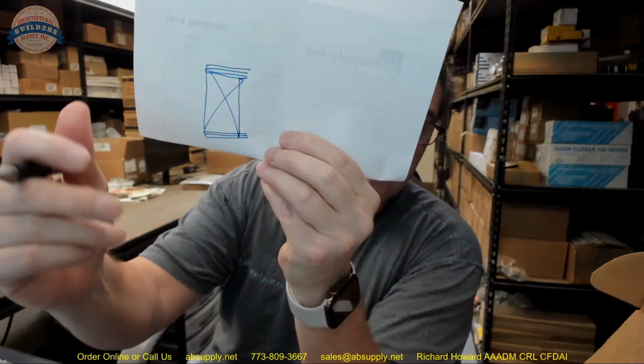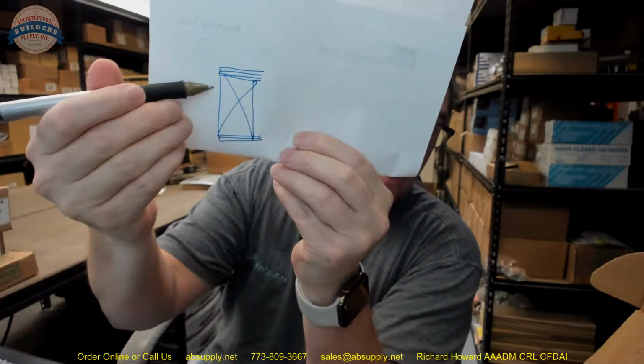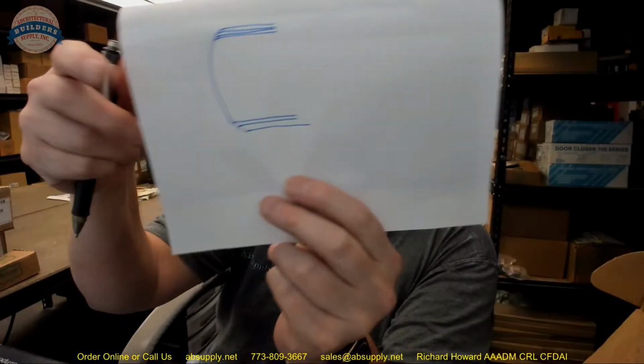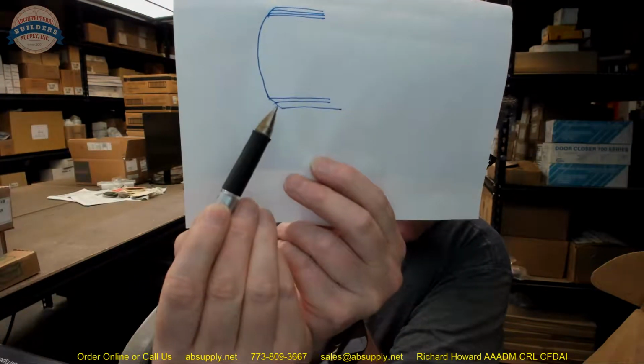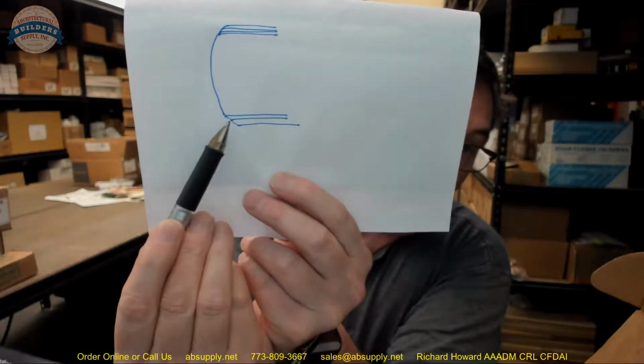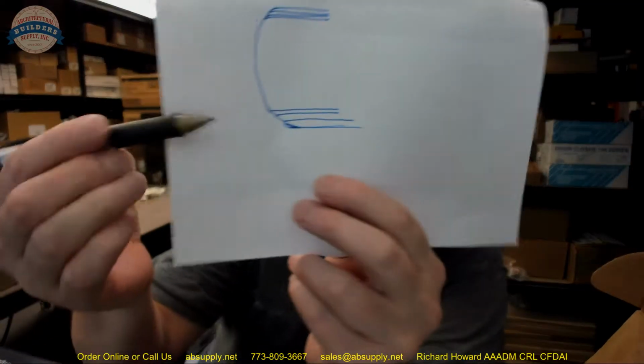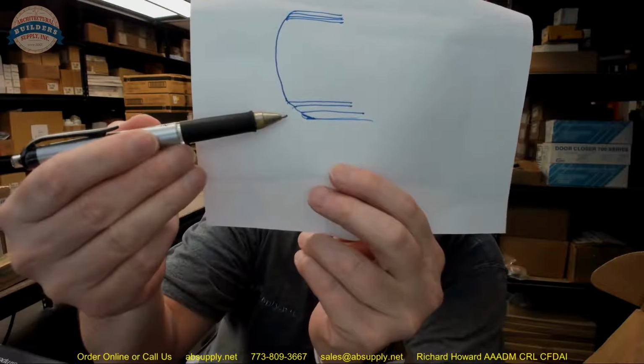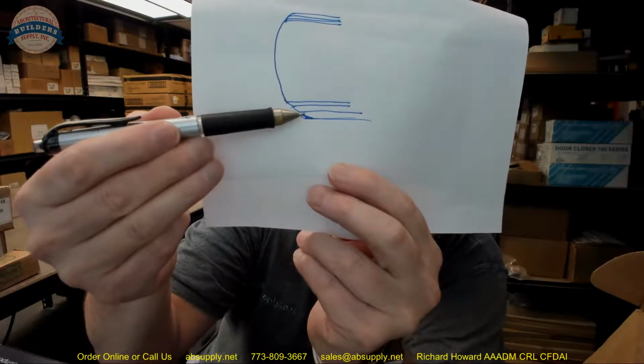The difference here is there is no discernible width between these layers. 3 plus 1 plus 3 is 7. That's a 7-ply door. That's going to be a veneer, a crossbanding, and a backer. A veneer, a backer, and a crossbanding. But when you turn it into a radius door, you substantially increase the visible... You therefore create, and I've only got 2 of them here. I'm exaggerating it, but you're going to see the areas at the tip of my pen.